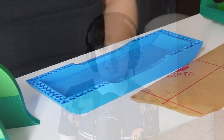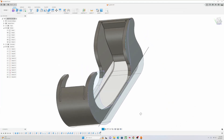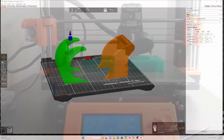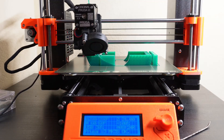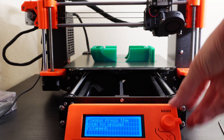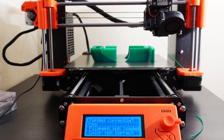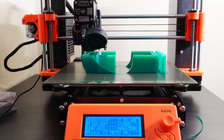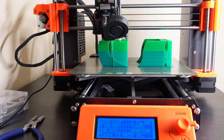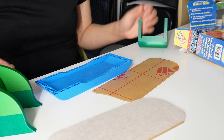At this stage I was left with a partially printed tank — the blue piece you see in the photo. I didn't want to waste the printing material, so I cut the 3D model at the height where the print crashed and printed the rest of the model separately. I wanted to disguise the seam between the two prints, so I printed the rest in two different colors to make it look more deliberate. I used the change filament option to switch filaments about 50 percent into the print. Once the prints were done, I super glued the pieces together.